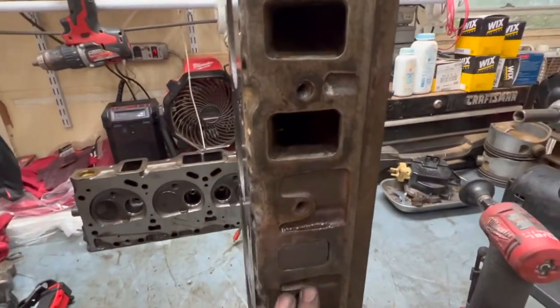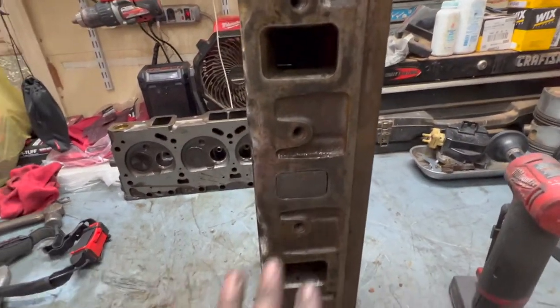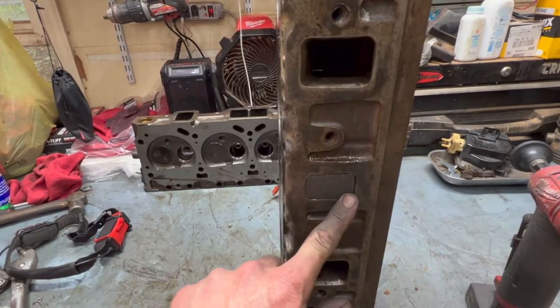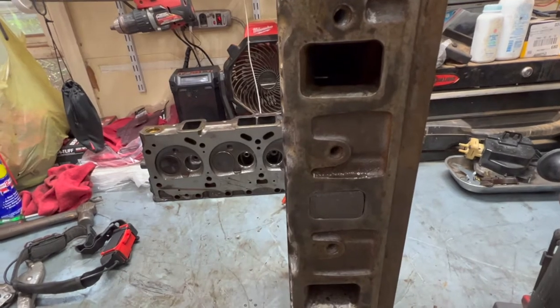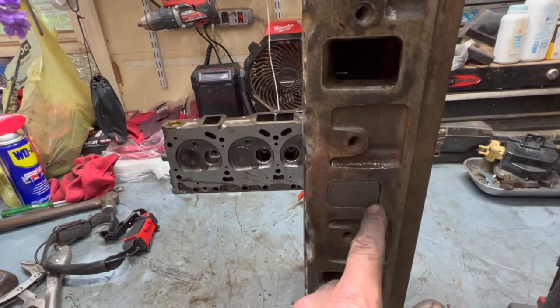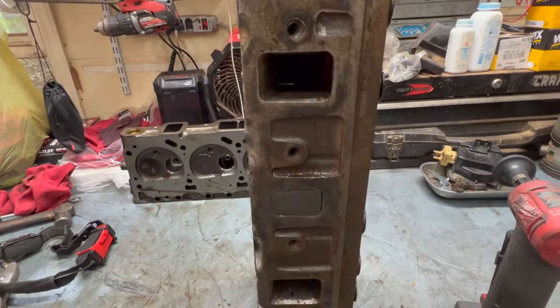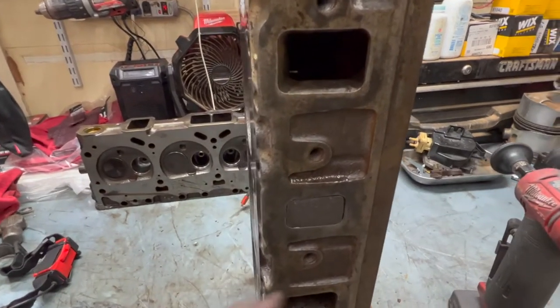We just got the other side done and it's all smooth. This one went a little bit better - almost had it as a press fit, then it started hitting; needed just a little like a fingernail's worth taken off. Took a little bit off and now it's not a press fit - it'll come out if I tapped it.